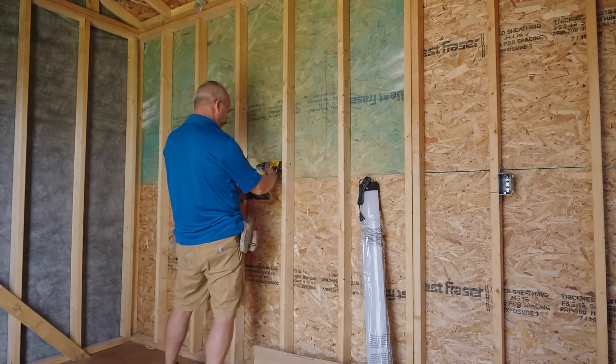Okay, let's do this again. That's the top, that's the bottom. Power in on the bottom. It's just for the help of tracing the lines down the road, okay? If there's ever an issue, it's nice to have a system. All right, that's done. Now we can flip it. Now we've got the neutral coming from the panel on the bottom, going to the next switch or plug on the top.